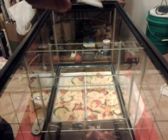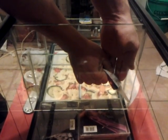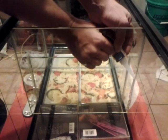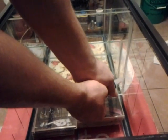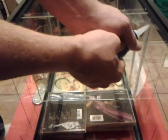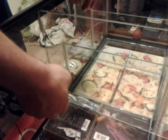We're going to put a bead of silicone on each side. It's a little tough to access this one since I just put another panel in before it, but pretty easy enough to get in there — it's got some space. You're going to put a nice even bead of silicone along the joint. Then you're going to come around and do the same to the other side. You always want to try to get both sides. Depending on the size of your gap, you're going to want anywhere from about a quarter inch thick bead.